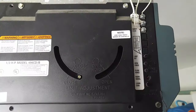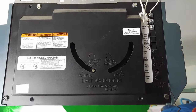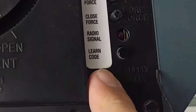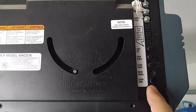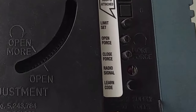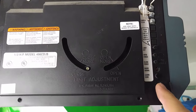Go into your garage and find your garage door opener. On the back of my machine, this particular unit, everything is labeled. What we're looking for is the learn code button, which is labeled right here. Now, in some Genie machines this button is located on the front side, and you have to take the cover off — the one that goes over the light bulbs — to gain access to it.